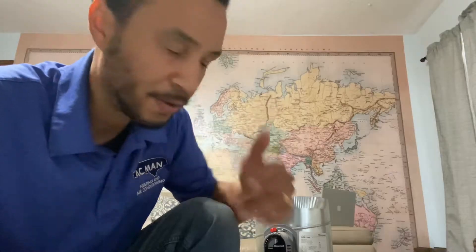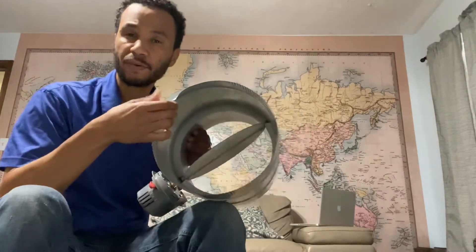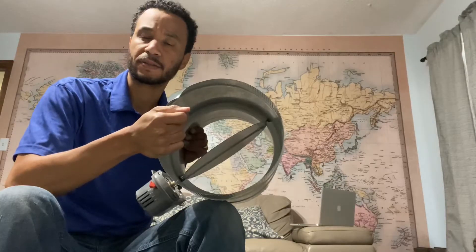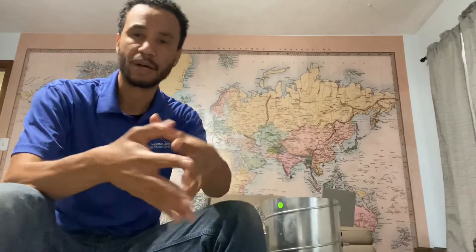That's how you wire a damper. First thing you've got to do is figure out what position it springs to automatically and what position you need power to put it in. This one is open automatically — it takes power to close. This is a power close damper. If you have any questions, leave them in the comments. If you have ideas for what video to make or questions on what component, just put it in the comments and I'll make it. Easy as that. Have a good day.